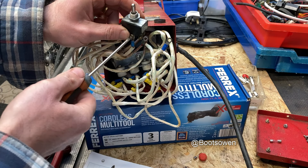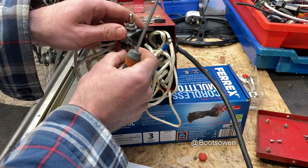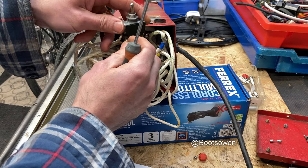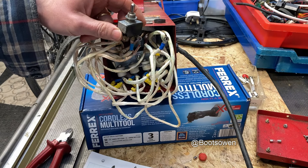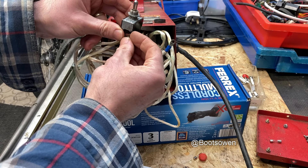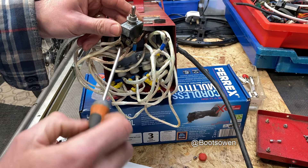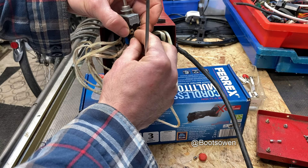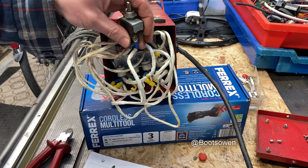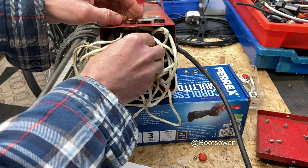Round to the center is what I'm going to do - that's the element - and then 220 on one side and 110 on the other. To disable 110, I guess you just take the fuse out. 110 should be on this side because that's the way the lighting works. I need to keep the lighting and the little label on top the same. So the moral of the story is keep everything, because you never know when you're going to need that switch you pulled out of what maybe was a floor polisher.